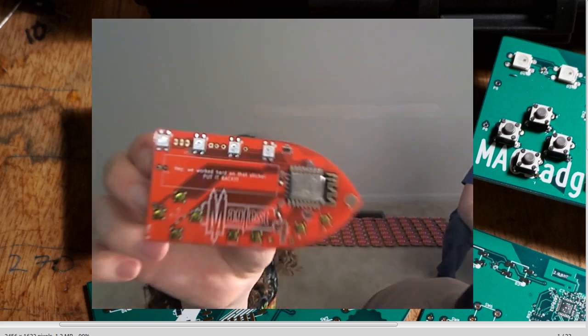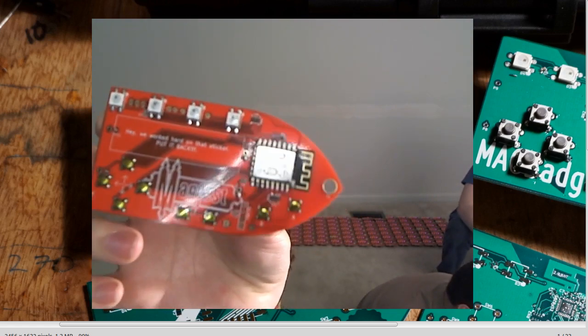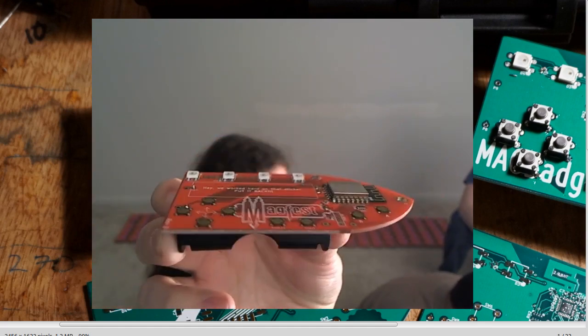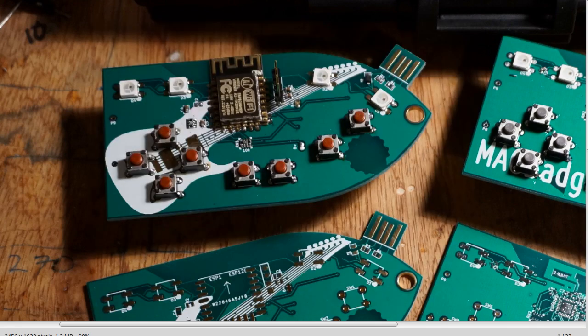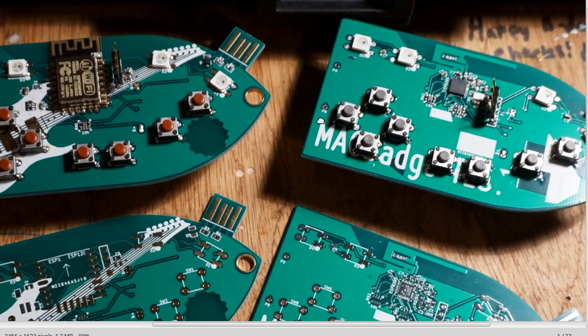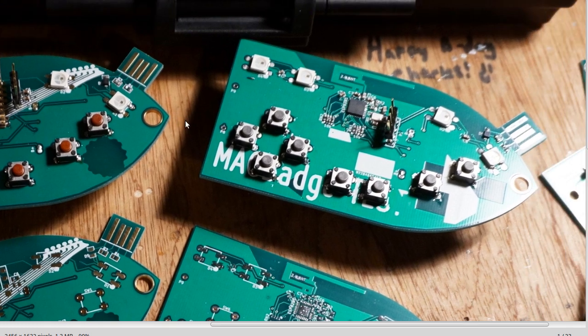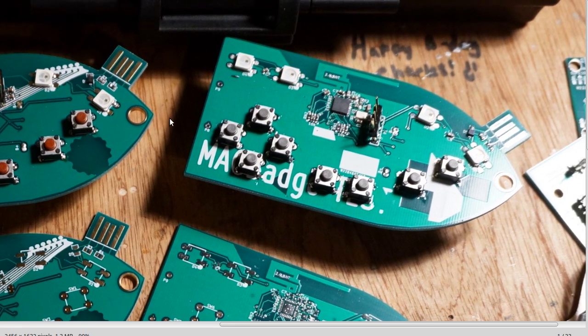We kind of got stuck with these funky little buttons. And somewhere in China, there's an office with 16,000 of these little red buttons right here. So say it again. The best buttons. Yeah, the best buttons. There's 16,000 of these sitting in some office in China, and how I wish that they could have been on our board. But I'm pretty sure it was my fault, but there's still some questions. Blame doesn't lie, it's my fault. Well, yeah, but where you got the footprint. Always check your footprints, triple check your footprints, or we probably should have gotten these things test run first if we had thought ahead.